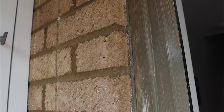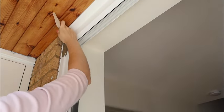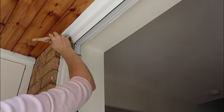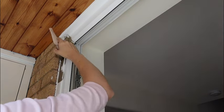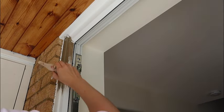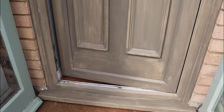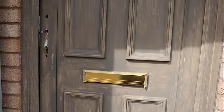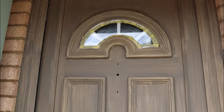I needed a chair to be able to paint along the top edge. If you need to stretch at all, it's a good idea to get a chair or ladder so you're comfortable at the height you're working at and not trying to stretch, which causes wobbly brush marks. Essentially, if your first coat of paint looks good, you're probably putting far too much paint on the brush — it should look pretty horrifying to start with, knowing it will get better.